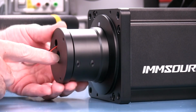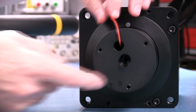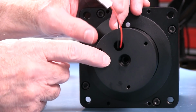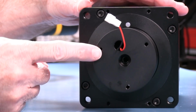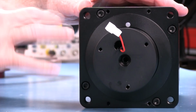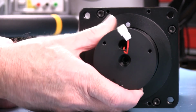We have a flathead bolt that goes into the shaft. There's actually the shaft sitting right behind this plate here. Now, I took that out too, but it's still not budging, which means this is a pressed-on hub. Now, I could get this off with some effort and get my tools out and take it all the way off, but all you're going to see is a hollow hub, basically.